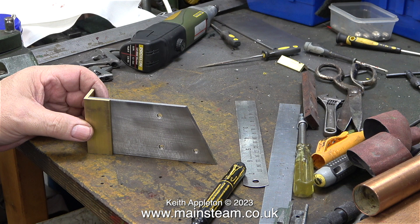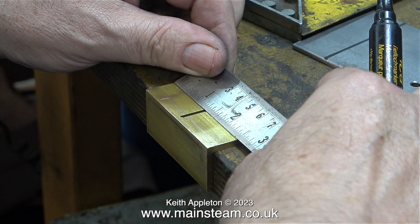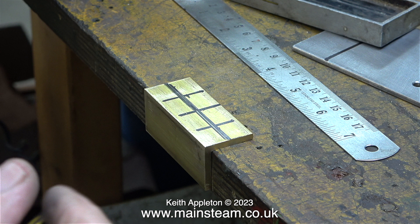From a strength point of view I am sitting the brass angle on top of the piece of steel, and what you're seeing at the moment is the layout for the first of the uprights, the right-hand side one. The first thing to do using my steel rule is to measure the length of the piece of brass, and it is two and a half inches. I've drawn a line on the piece of brass at this point. The next thing to do is to measure from the centre to the outer edge and draw a line at the midway point.